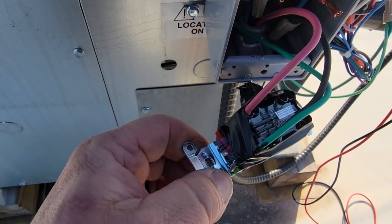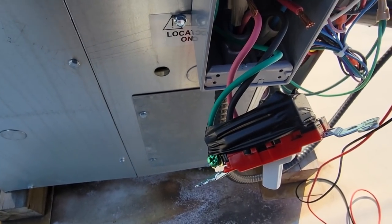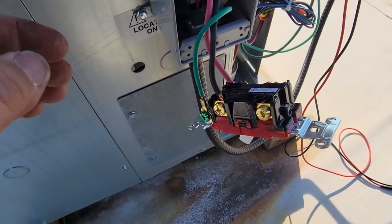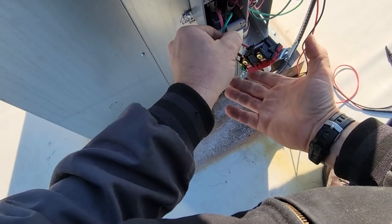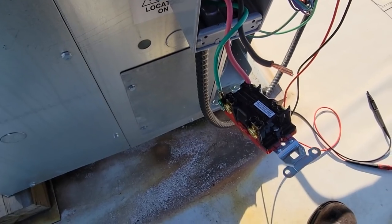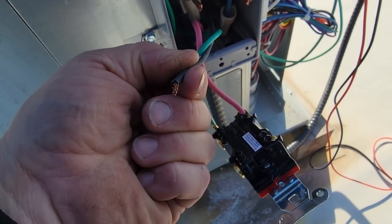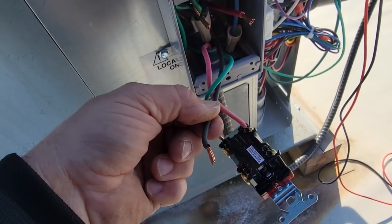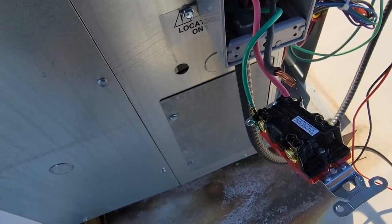This call-out costs more money than that switch does, so it's just not worth it. We're going to get a new switch. I give it a little tug and I really need both hands to show you — yeah, that's a problem. Unfortunately they didn't get tightened up, and that looks like it ain't even the full-size gauge of the wire. It almost looks smaller. We're going to go ahead and wire-nut the puppy together.